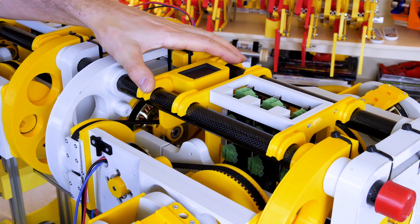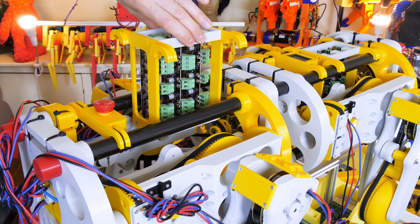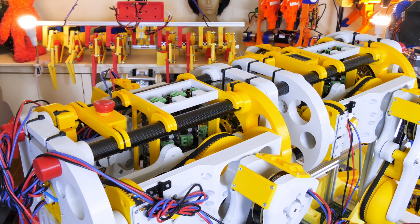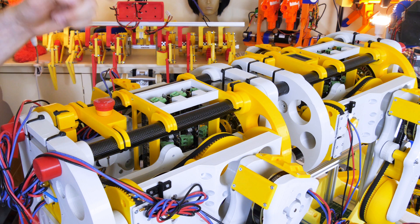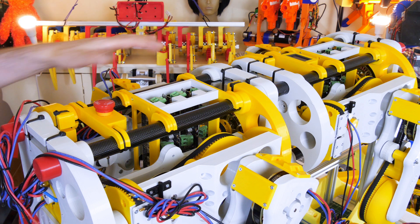For starters, I want to keep an eye on the battery voltage. At the back, of course, we've got another three O-Drives because we need six in total. Each O-Drive controls two motors and there are 12 motors, which is three in each of the four legs. We've also got an emergency stop button, and that's just going to reset all the O-Drives — it takes the reset pin to ground and that'll immediately cut the motors if there are any problems.